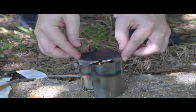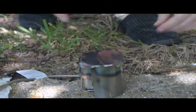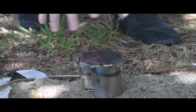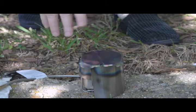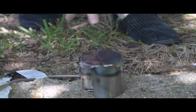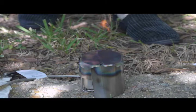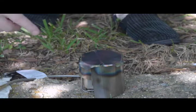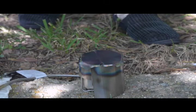I'll put the lid on like I normally do, and you can see that there's a little bit of flame developing as a result of some of the fuel that's in the line. This is normally what happens with this technique. It begins to start vaporizing fairly quickly. This little bit of fuel that's in the line assists in getting the burner going. So I actually now routinely put some fuel in the line. I don't want it spilling out because that makes more of a mess than I need, but I want a little bit in the line. Most of what you see here is actually stuff that is vaporizing, not stuff that's spilled out.